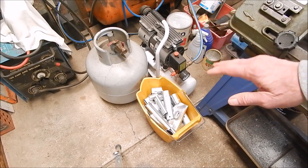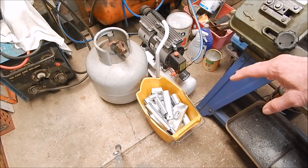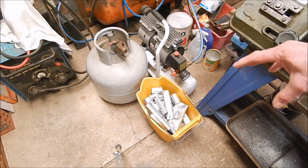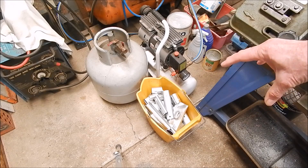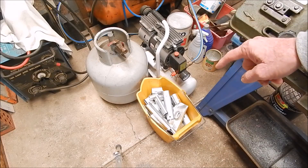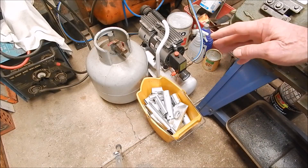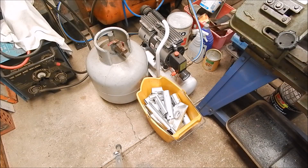Whatever you're melting, be aware that not all aluminium is the same — not even remotely the same quite often. Aluminium used for something like a lawnmower deck will be soft and not very good machine-wise, whereas something like this could actually be good. Even though it hasn't been machined, the actual function it's been used for — which is high load, thin wall — it should be pretty good stuff. There's quite a bit there.